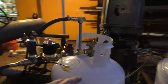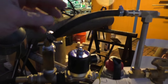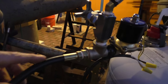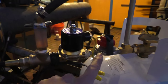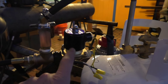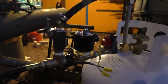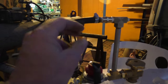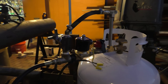There's a T coming off the tank and this line just goes up. I had a regulator up here but that didn't work out — I'll tell you why in a bit. It comes down through this valve that kind of regulates like a pilot light. That keeps the burner on and running but not enough to bring the temperature up to a thousand degrees. Then this regulator is on — we got tape so it didn't wiggle loose — and then that PID just opens this valve up and lets additional gas in, keeping it at a thousand degrees. When this kicked on it pushed back pressure up and a little bit of gas leaked out of the regulator, so we just did away with it. Redneck engineering wins again.